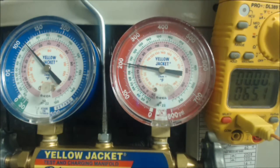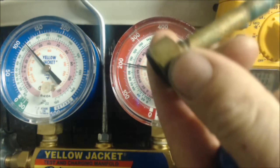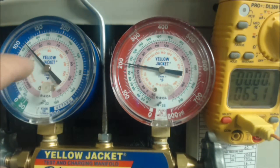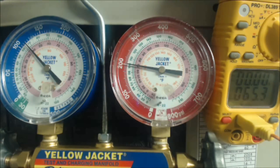But since we have a piston on this system, you would check it with the blue side — that is the low pressure side. Most 410A residential split systems are going to have TXVs due to energy efficiency, but you still find ones that have pistons, and a lot of R22 systems that have pistons and some capillary tube systems still out there.